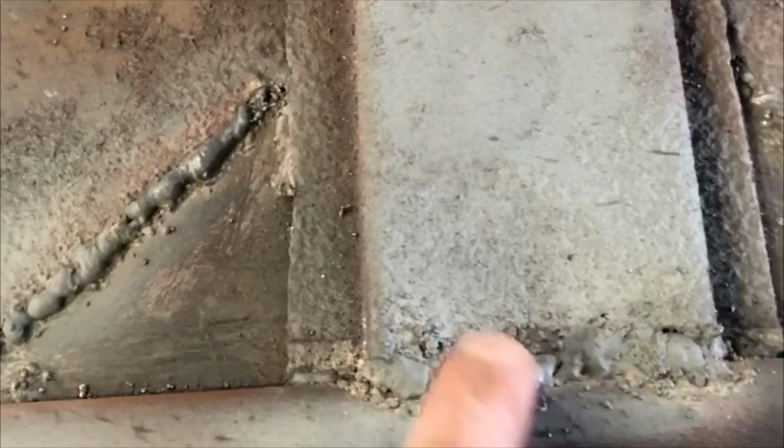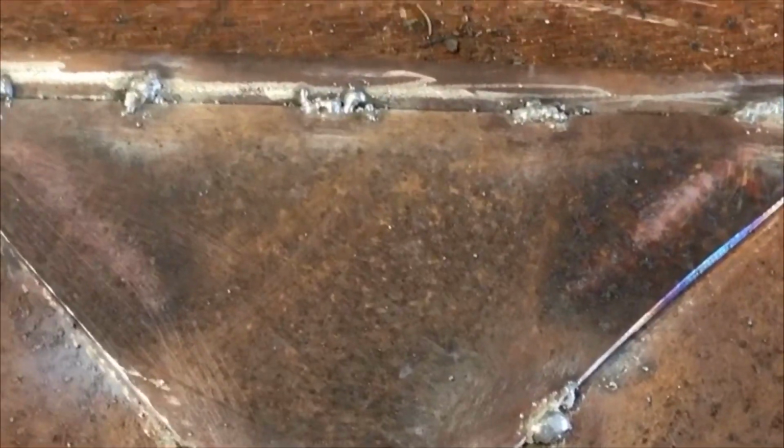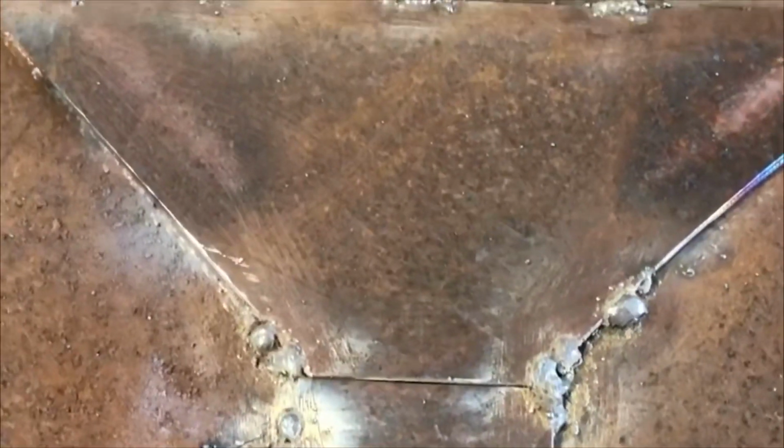The pipe is welded going across there. I attach this middle member to here. I'm going to leave the welds kind of rough right now, just so it looks along the line of the whole patina of the whole thing. I'm just going to leave it like it is and let it age for a while. What I also did was put a reinforcing plate on the back. I used that old oil tank material and just made it so everything is attached together, the front member of this, the back patch and the pipe.